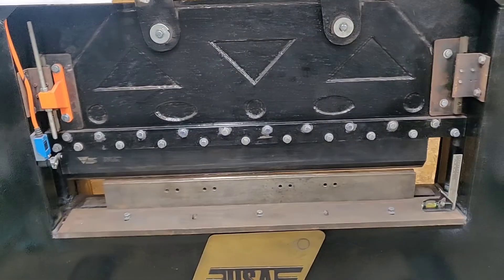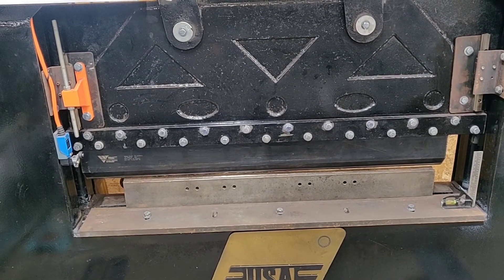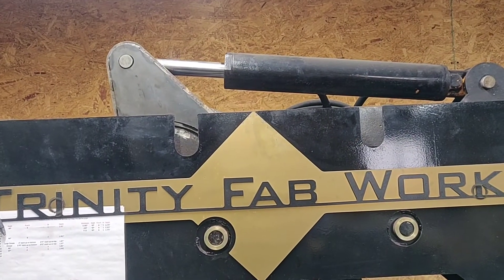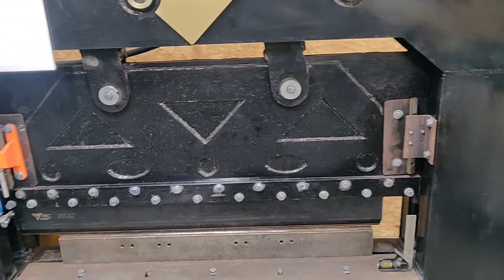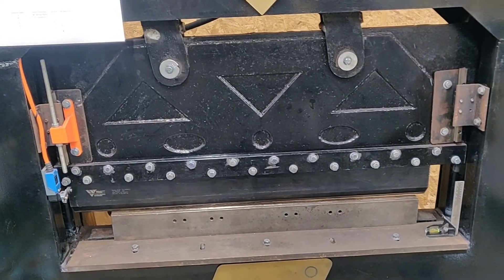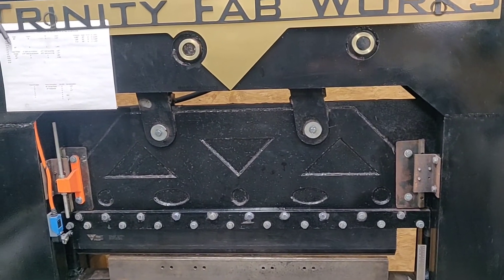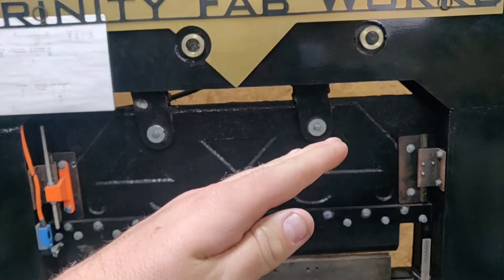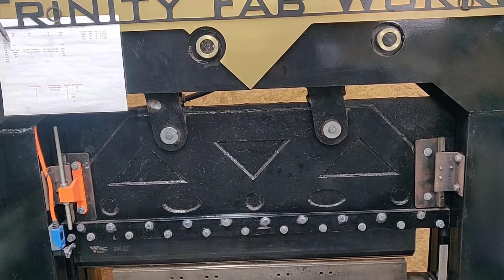It's a 7/8-inch plate laminated with 3/16 on both sides, and it's got some shackles up above it. It's got like a 3-to-1 mechanical advantage with that ram and the cantilever setup. You can adjust it for levelness. I know some other people have built cantilever-style press brakes and had issues with it going down crooked, so I made it adjustable. It's threaded so you can make fine adjustments — if you're getting two degrees tighter on one side than the other, you can adjust that.